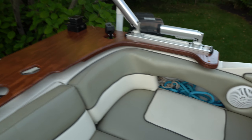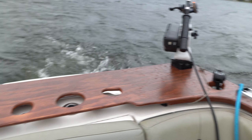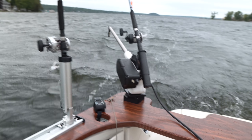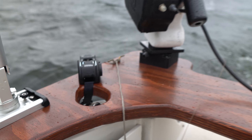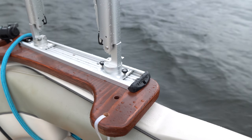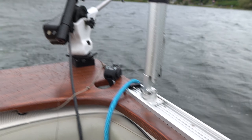What we have is a wooden platform that'll attach to this cleat. We have an anchoring point under there to that rail over there and then to this last cleat, and it'll make a nice fishing platform so you don't have to drill any holes in the boat. What we have here is a boat buckle, and we have the hook portion of it going underneath the cleat and then we just clamp it down like that and that holds it really stiff.